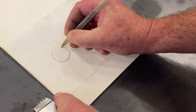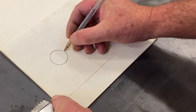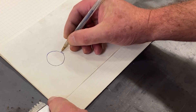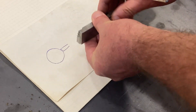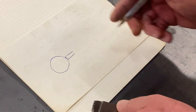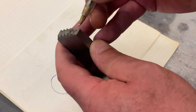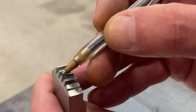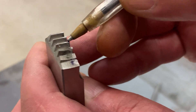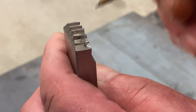Basically the way these things work - if this was a rod you wanted to thread, that radius would kind of live in here, something like that. And then this is a clearance behind the cutting edge - that's what this radius is doing here. These teeth automatically clear; there's clearance built into that and it's all to do with the dynamics of the head that holds these things.